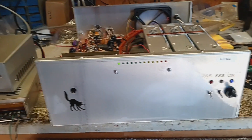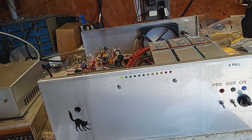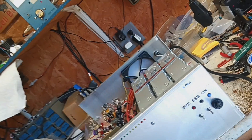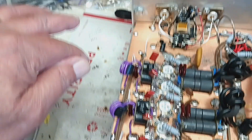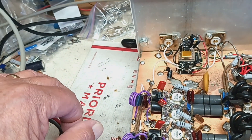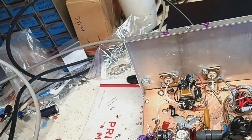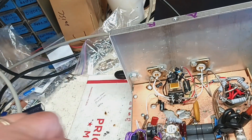Alright, I got your 2290 — you had two blown ones. Got all the solder globs off of it. I totally took the input side out and rewired it, put new chokes on it, new feedback. I checked every component in here.